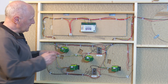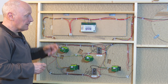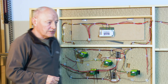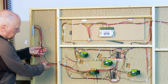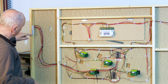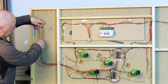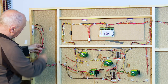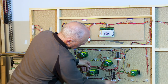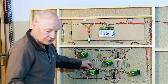What I should do now is connect this all up to a bus and then come back to you. And then we'll run a train on top and hopefully see how it works. So here we are now with these bus wires in place, and they run from that chocolate block I showed you earlier. The top two are the inside and the bottom two are the outside loops. So they simply run down here through there, and then they split and go onto the two tag strips.